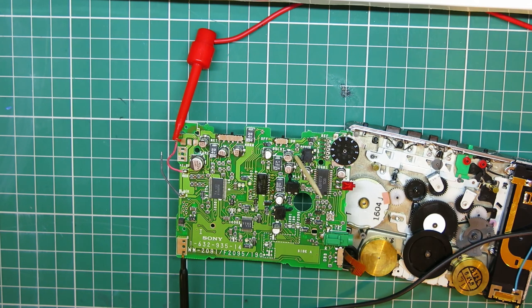Now, I'm not completely confident about this, and this is why. Let me turn the power on. You hear it making that grinding noise. Now, that was the noise that my first one made that turned out to have a worn out motor. The one that I sourced a motor from that worked ran fairly smoothly when it was unloaded. It's drawing about 40 milliamps at 1.5 volts there.